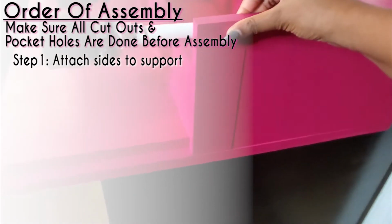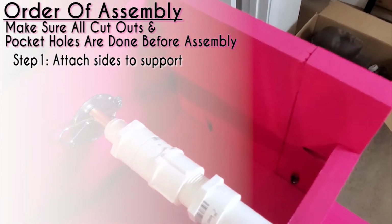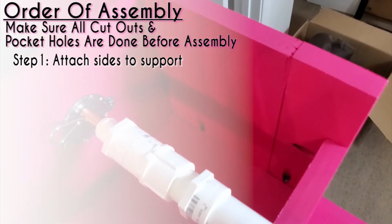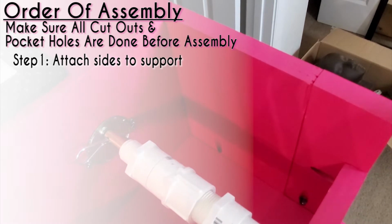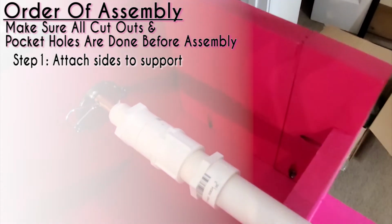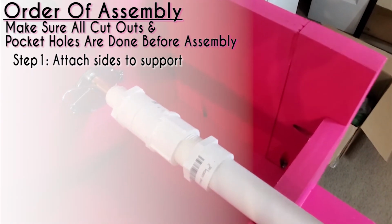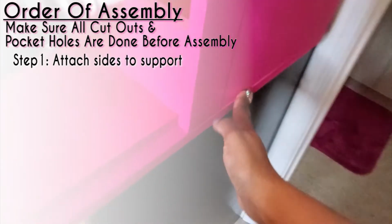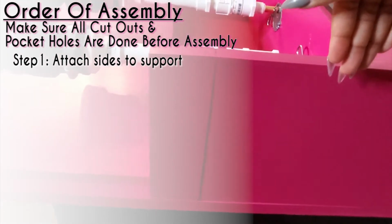The way I got this on without wood screws is I use pocket screws. If you look down in here, you'll see a pocket hole. You can buy the pocket hole jig off of Amazon. It's about $14. It comes with the jig and it comes with the drill bit. You can buy the pocket screws at Home Depot. Had this been all one piece, it would have just been 2 pocket holes that I would have done. Again, make it flush on the side, make it flush on the back, and screw it in.